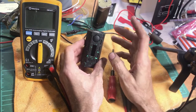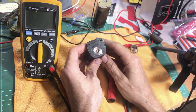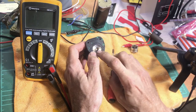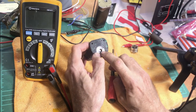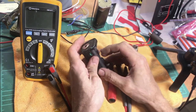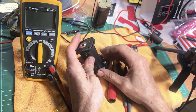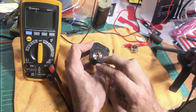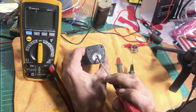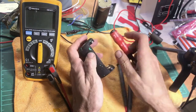Say you've figured out for sure something's wrong with your device — all you're getting is errors and you can't fire it. Pretty simply, the 510 is just a negative, which is the outside metal area, and a positive, which is the inner pin or pad. These just go back to the main board — we're talking about regulated mods here, this is not applicable to mech mods. All the 510 has to do is get connection from your atomizer back to the board. Pretty much every 510 is spring-loaded these days, so there can be problems with that mechanism.